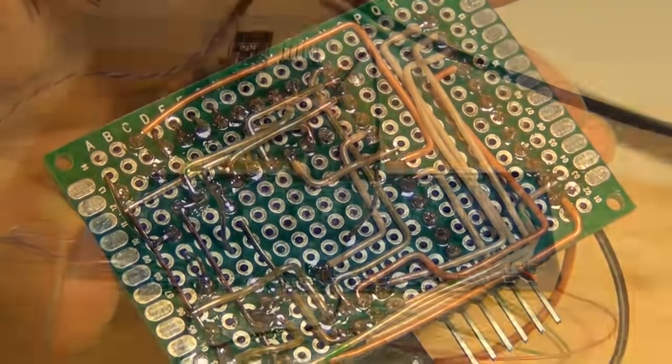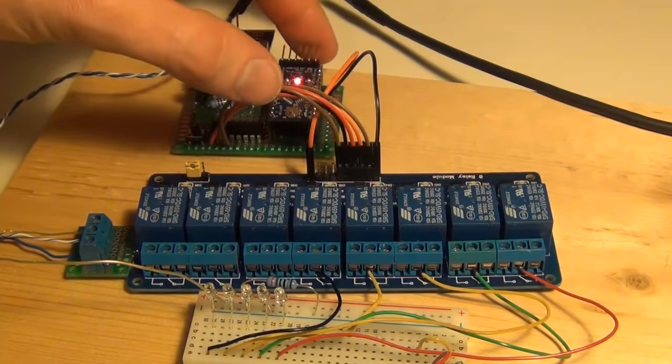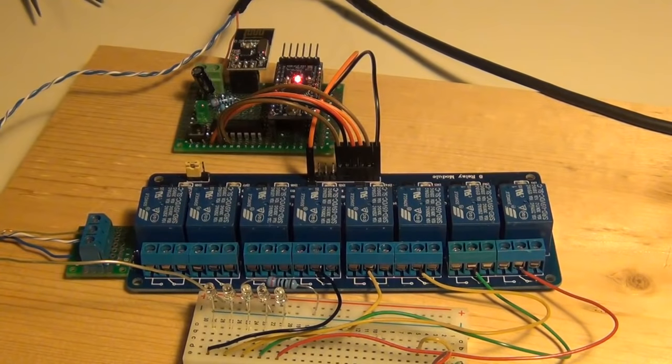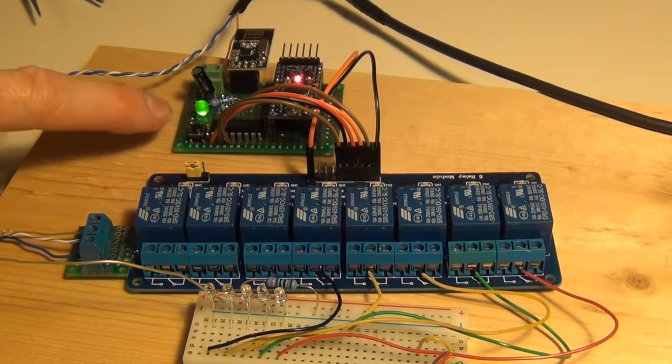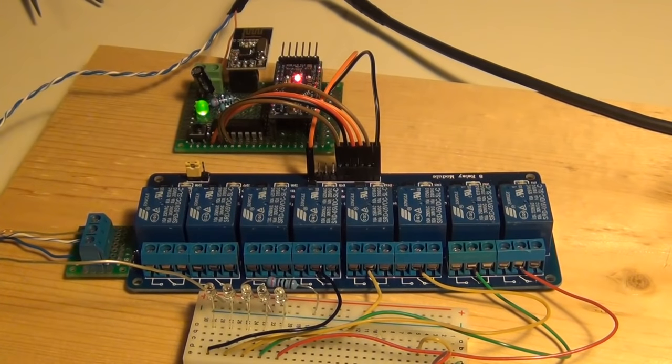I wired in my pull-up resistor and connected it to my 5 volt power again. Notice my Arduino is lit up and the onboard LED is just barely flashing — that's downloading the data from Vera right now. Once it's finished, this status LED will start slow flashing. It's finished downloading all the data — notice my zones didn't start up, so that resistor has helped with my button, and the button will still work when I press it. Notice the fast flashing indicating it's starting a cycle, and then after 7 seconds my first zone will light up.